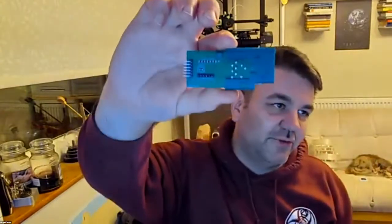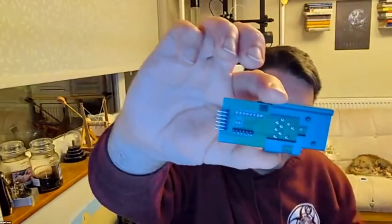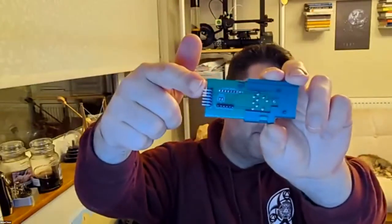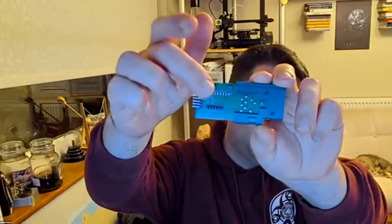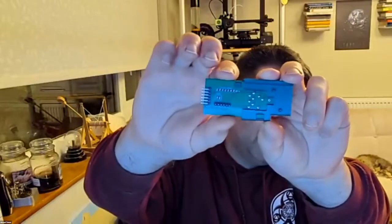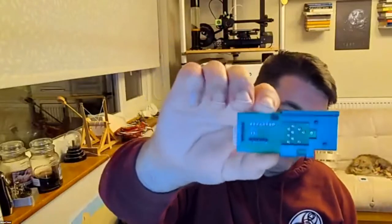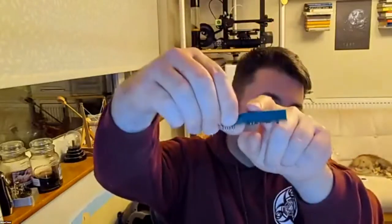So that way you can just push it onto the PCB, and these connectors here, that's to program the PIC, and that's to program the Wi-Fi module. So it allows you to do both of them on the board, in-circuit programming, but you literally just press and hold this onto the PCB, and then it all programs. So there we go.